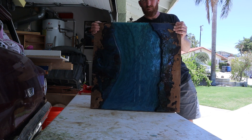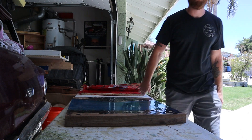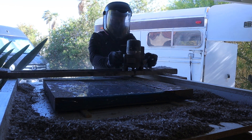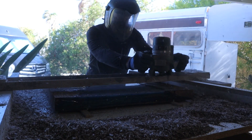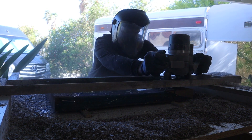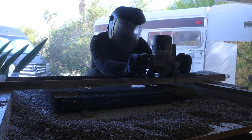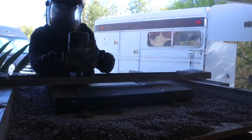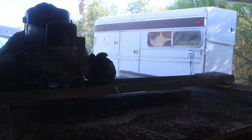We got the piece out of the mold and it's ready to take over to the router sled and start flattening it. This part of the process is pretty fun — it's a little nerve-wracking. Sometimes the router can jump on you and scare you. I always glove up, wear long sleeves, and wear a face shield because chips of resin go flying everywhere. I was doing this in short sleeves the other day and afterwards my forearms were all scratched up with little shards of resin stuck in my skin — so definitely armor up.